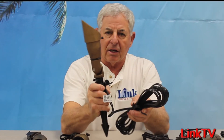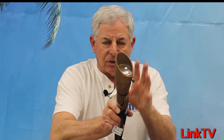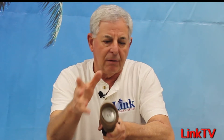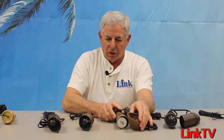All these fixtures have really good tight seals and good knuckles. These are all brass fixtures, and we'll show you a couple of aluminum choices. This is a sand cast bronze fixture — very good fixture, probably the heaviest and toughest fixture on the table. It's not a pretty fixture, but if you're in a beach environment with blowing sand, it's an excellent choice because the looks of it will hold up even in a sand abrasion condition. This is a floating socket fixture with the heat shield in place, very easy to lamp. It holds the lamp up against the convex lens and has very good sand abrasion characteristics.